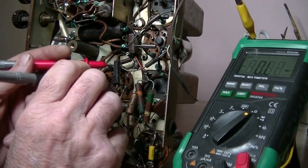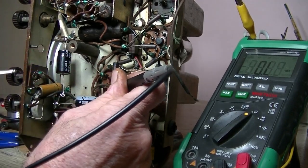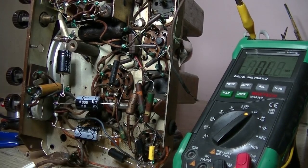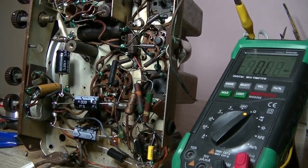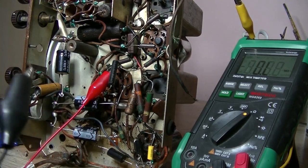And I've been trying to get a reading off this, and I get absolutely nothing. And I've scraped the wires clean on both ends, and you can see there's just absolutely nothing going on with this. So I thought to myself, okay, should have hopefully a 400. Don't know if it's 8 watts, but anyway, I've got a 460 ohm at 5 watts, and let's just jumper it in and see if that makes any difference. Just one end up there. Where are we here? And so there it is.